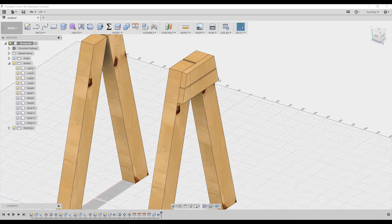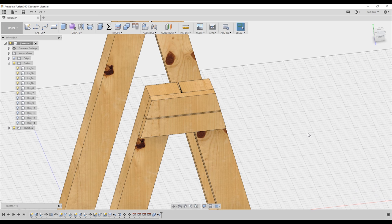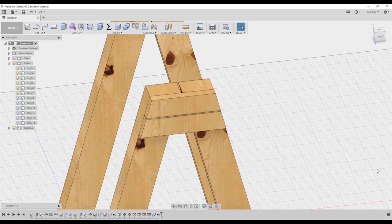The pallet had four thick slats and I cut them all to an identical size. I also cut a 15 degree angle at the ends, making sure that the cuts were parallel on the same slats.